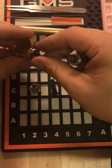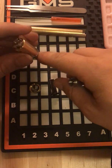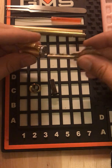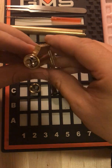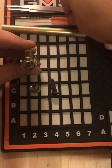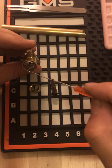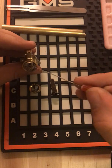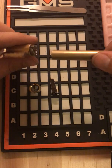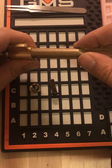Now I've got this apart. The new modular style cylinders have this cutout that allows them to be converted to a bunch of different functions. Those usually need a special type of follower for ease of use, but I'm just going to turn it to about 2 o'clock so I can still use this ridge to guide the pins and not have them fall into this ridge. This is a Keydex demastering follower — this ramp allows you to basically ream out a bunch of master pins if the cylinder was mastered.